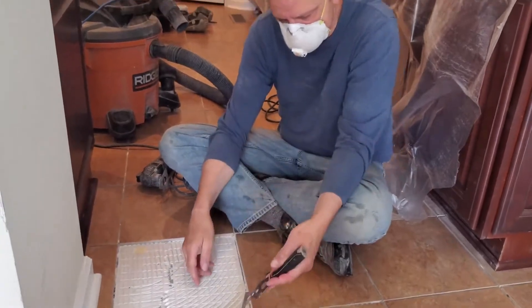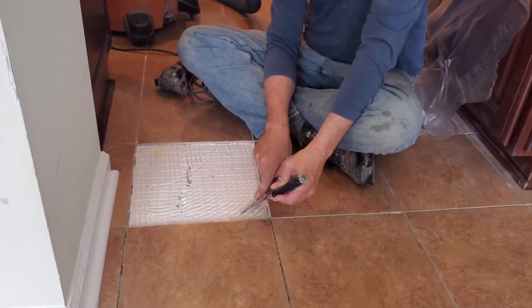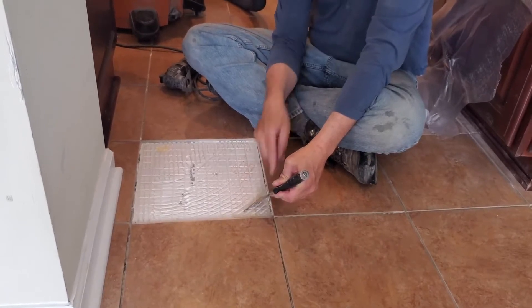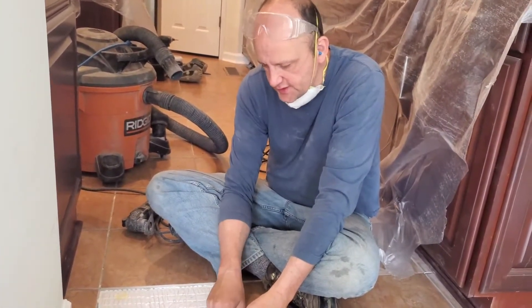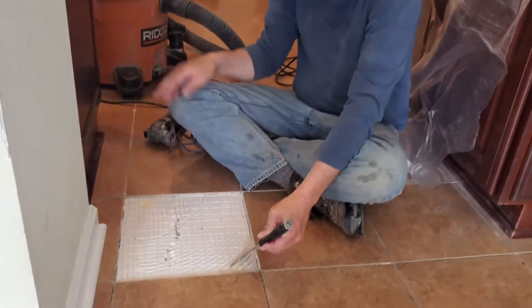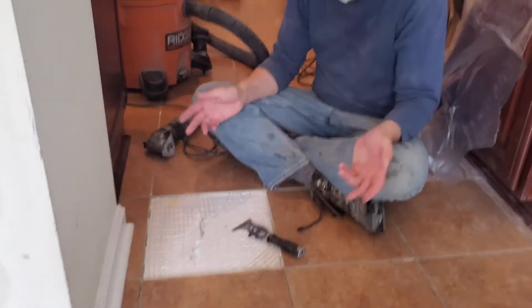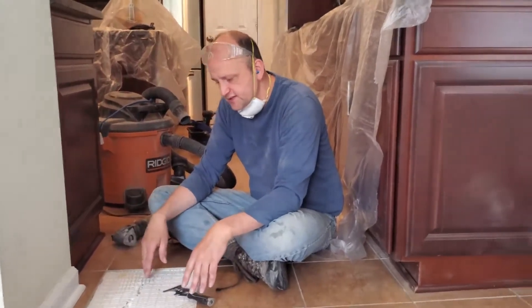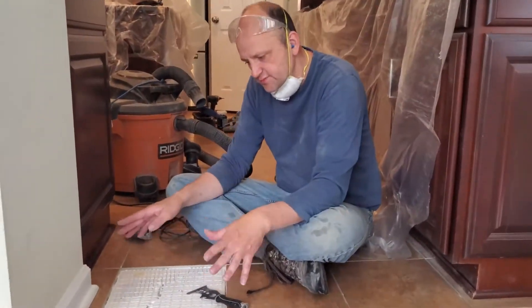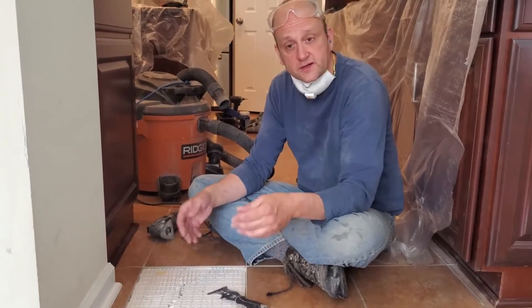What we're going to do here is take this 5-in-1 and put it in along these lines to chisel this out. As I chisel, it will still be a bit rough, so we're going to go back over this with an oscillating tool. This is going to take a little bit longer, but since it's a single square, rather than cut out a single piece of hardy backer board, I'm going to show you a different method of clearing off the board so we can set the tile.